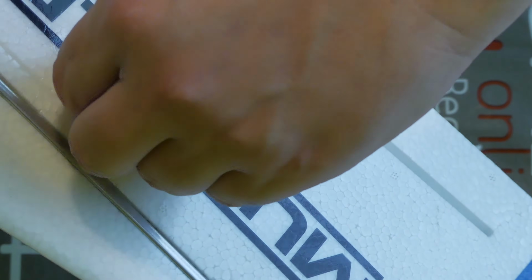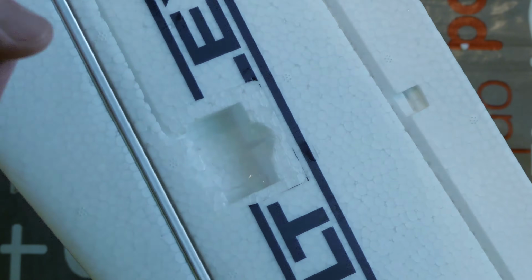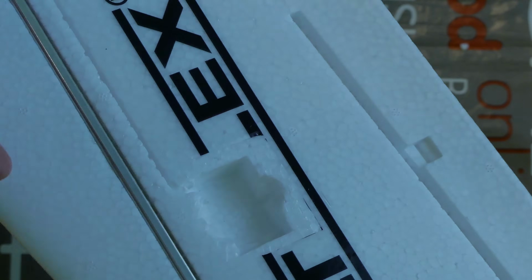easy. By the way, much better and much easier than gluing with second glue, cyanoacrylate glue, and with debonder for cyanoacrylate glue. This is much easier. You can see here how easily you can remove pieces of hot glue from the servo. Now you just wait until the alcohol inside vaporizes. Just when the hole is clean of alcohol, you can put a new servo inside. I will show you now.